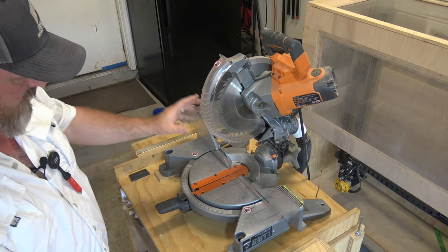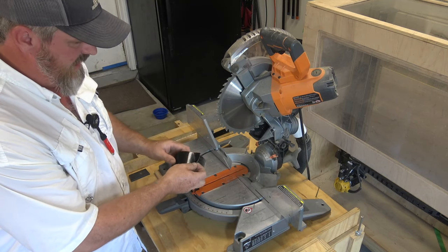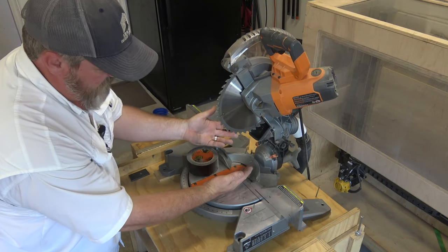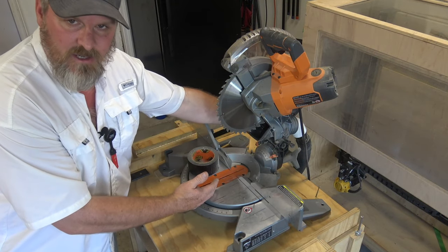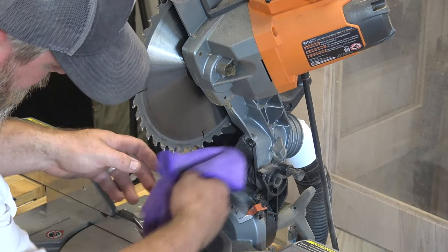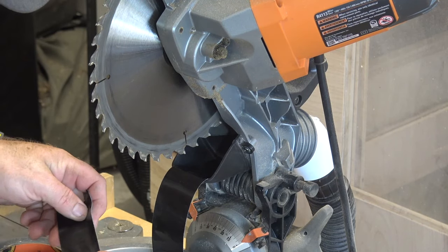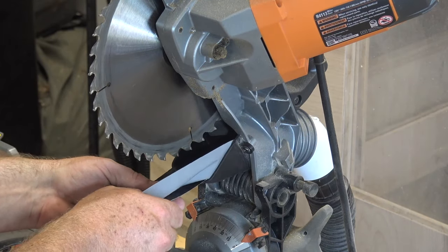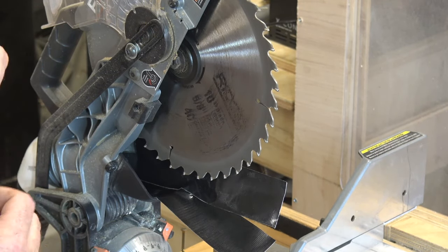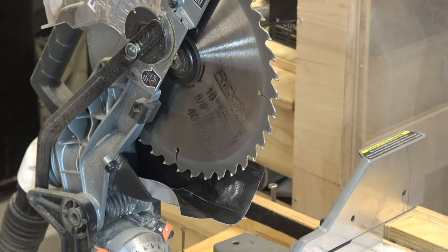I have the machine off and unplugged. I'm going to pull the guard back and lock it in place, then take duct tape — this is Gorilla Tape actually. I'm going to clean this off and make a little shoe to go around that to collect more of the dust as it goes up in there, sucked down into the vacuum. I'll fold the duct tape on the sides to get it up on the edge, and run the tape past the actual coupling that comes with it so there's a smooth pathway to the dust collection. I'll run that all the way around and tape from the bottom, trimming off the front so it doesn't go on the other side of the saw where the fence is.